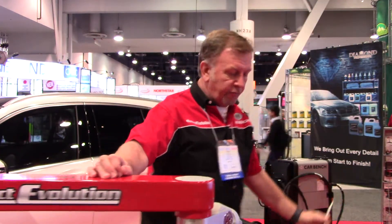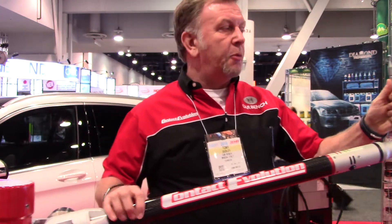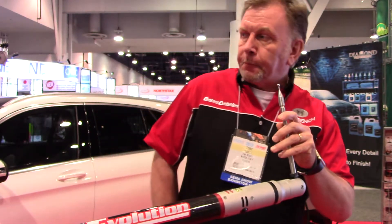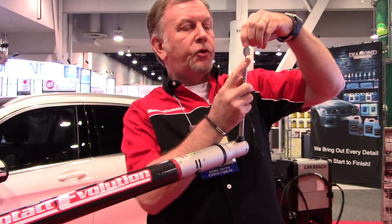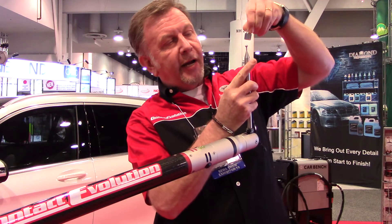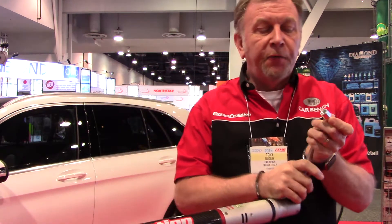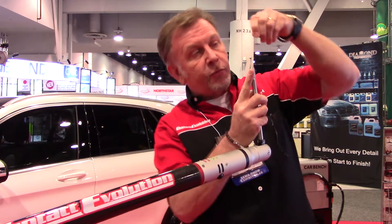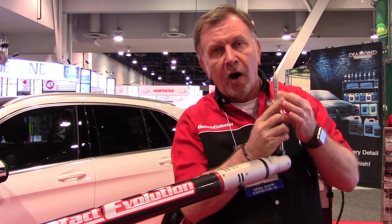It's all done off this unit here. No extensions, no cups. The measures are through the sphere at the tip here, where we normally measure — for instance, a bolt, which is a popular measure: 1, 2, 3, 4, 5, 6. And a hole, again: 1, 2, 3, 4, 5, 6. The first three measures mathematically calculate the hole centre, unlike some systems where we have to find the hole centre. So it's a far more accurate system.